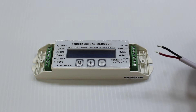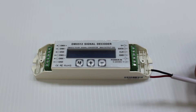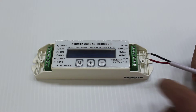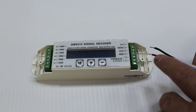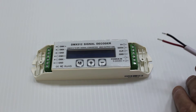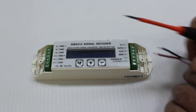You also need to make sure that your power supply has sufficient power to power all the pixels. Consult your manufacturer of the pixels to add up the total wattage required, and ensure that your power supply is at least that amount of wattage. In this particular case, our power supplies use the standard common method in the United States, which is positive is red and negative is black. We're going to simply loosen up these screws with a standard small flat blade screwdriver.